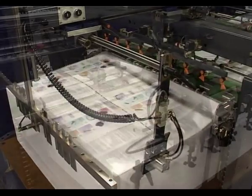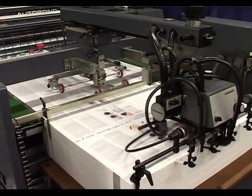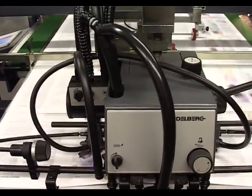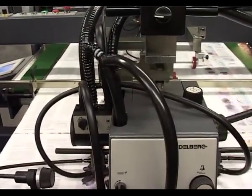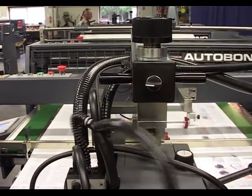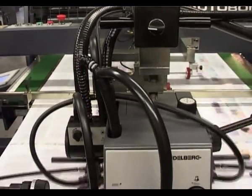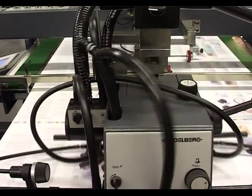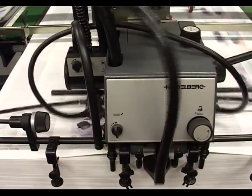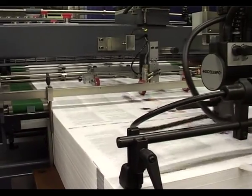The Compact 102 TPE is fitted with a rising pile back separation stream feeder with a servo-driven Heidelberg Speedmaster feed head. Sheets are stream-fed down the vacuum feed table and into the laminating rollers. The underlap on the grip edge of the sheet is produced by the Heidelberg feed head.